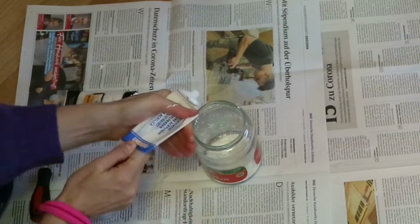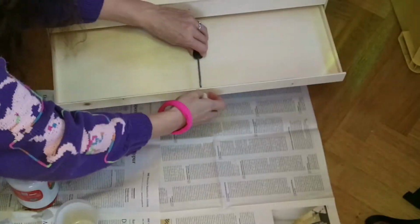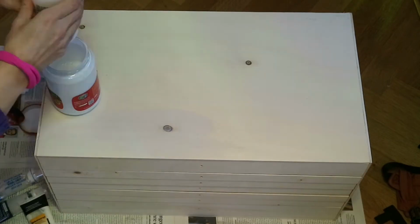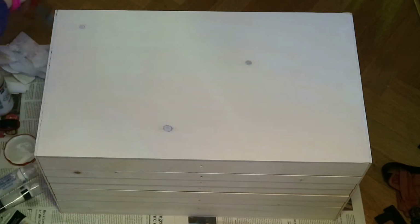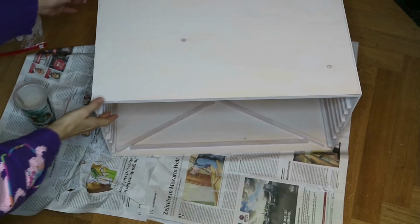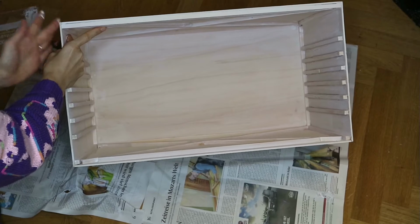I prepare a whitewash. It's basically water with acrylic paint. I use a lot of different brands of paint in this case. It's only to finally use the already opened and half-empty bottles in my stash. Basically, a way of tidying up and simply paint it all. The watered-down acrylic paint allows you to still see the wooden grain.